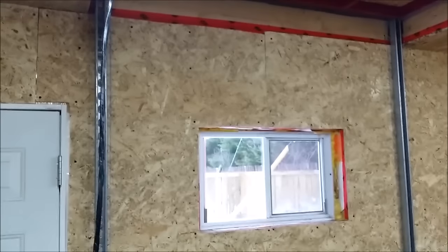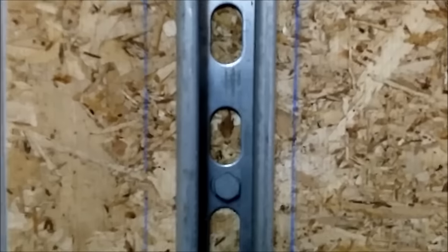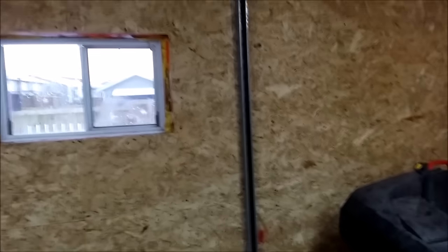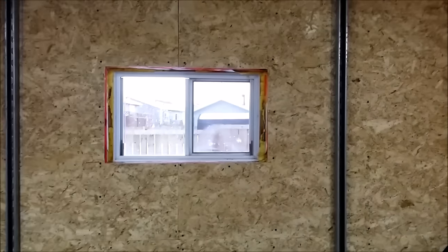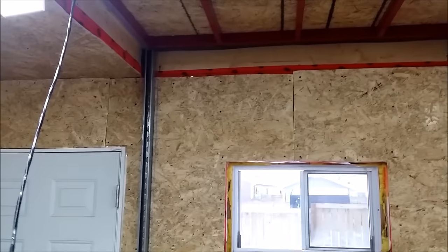First off, for rails and dollies, I used a piece of Unistrut 1 and 5/8 inch channel. You can see it's like a C channel with a bent inlet. I got this mounted to the wall with some lag bolts. What I did was I took down the sheeting on the inside of the walls, put in some extra studs — two on each side — and after fixing them in, I went ahead and bolted directly into those with my channel.